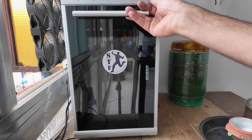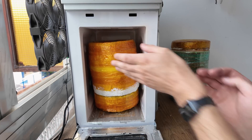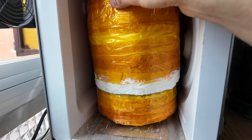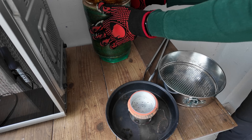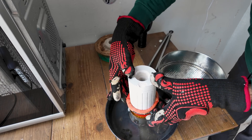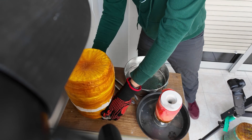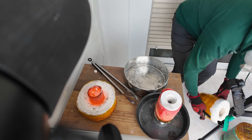After 25 minutes I have a peek — on camera it might not look very red but this should be molten already. Let me change my clothes and pour it. Sometimes I use silicone sleeves and other times aluminum foil. I do like the sleeves but the downside is that when things go wrong and there's metal leaking, they will catch fire — as you'll witness in a moment.